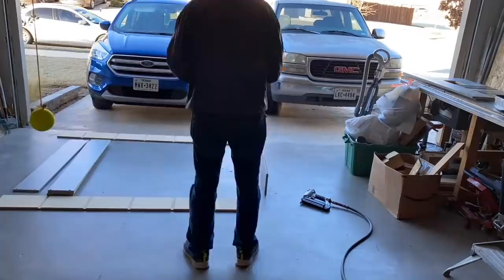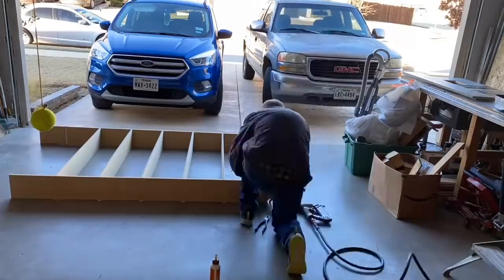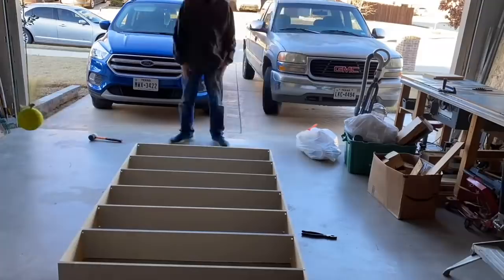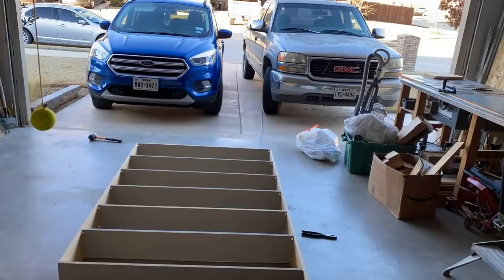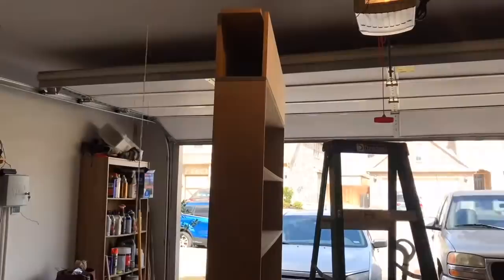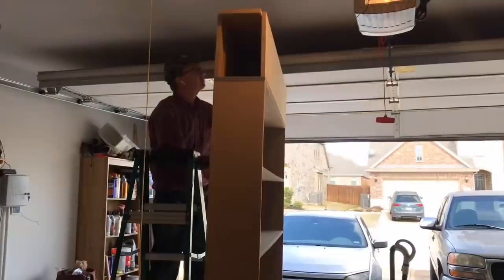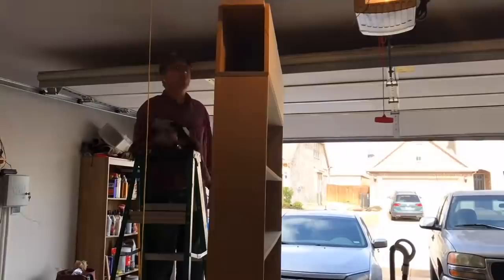I made my cuts according to plan. For the end caps I cut five-eighths inch gaps about halfway through and laid the shelves in place. I was able to use a staple gun nailer from Harbor Freight to put it together - it went together beautifully. I also used some Gorilla Wood Glue, which worked very well. I decided to add a top piece - it's not in the plans, but thought it would make it a little more stable. On the inside I also drilled two holes to help better guide the threaded rods.